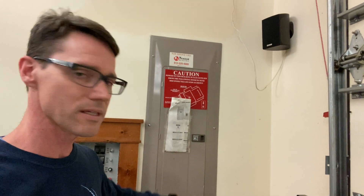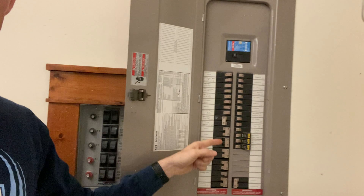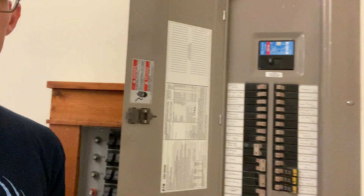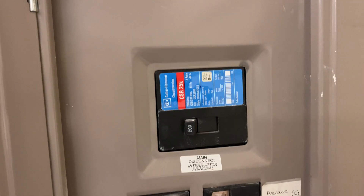The real reason that a dual charger makes sense for us is that our electrical panel is really quite full, and in order to put an entire second charger for our multiple EVs it would cost thousands to upgrade to a 400 amp service. So for our family, a unit like this — where there are actually two chargers and you can charge two EVs at the same time, or at least plug them in at night when you go to sleep — makes a lot of sense because we don't have to spend the money to upgrade our entire electrical circuit. It's a great solution for that or any kind of commercial solution where you have to have multiple cars plugged in at the same time.